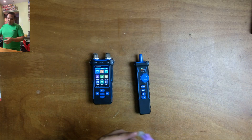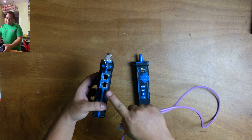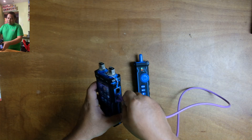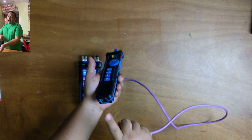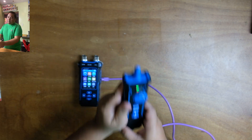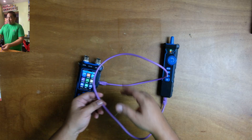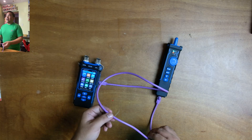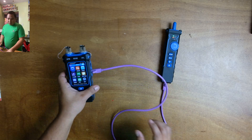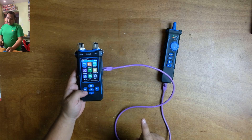For the first test, we're going to use a LAN cable with the CONT function. You can see the CONT port where you insert the LAN cable, and for continuity testing you also need the receiver — plug it into the bottom of the receiver. The purpose of CONT is to check if the cable is a crossover or straight-through cable, or if there are any issues with it. Let's select CONT and click OK.